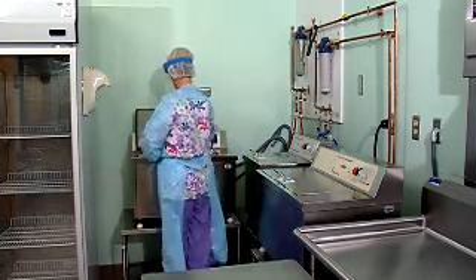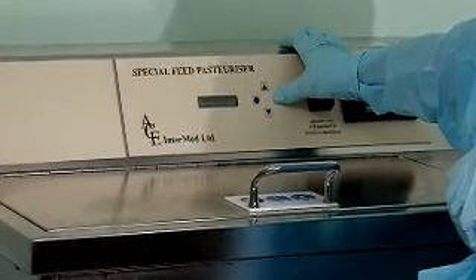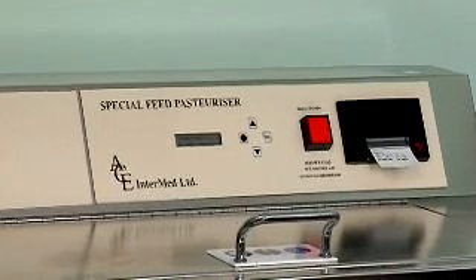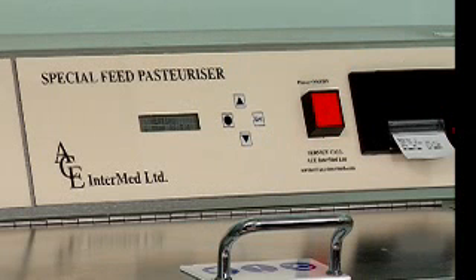The pasteurizer is pre-programmed, making it simple to operate. The process begins with water flowing into the pasteurizer to a pre-designated level. The water heats to a preset temperature, at which time an auditory signal alerts us to place the bottles within the pasteurizer. A hard copy of the minute-by-minute temperature prints during the process. After 30 minutes of heating at 62.5 degrees centigrade, the tank empties and the cooling cycle begins. There are five cycles of water filling and draining from the tank.